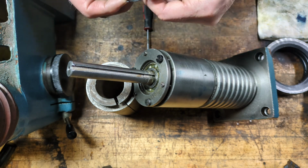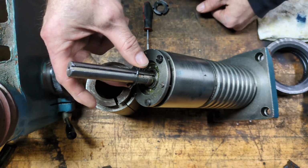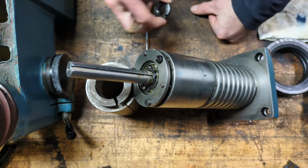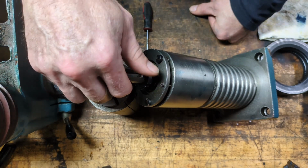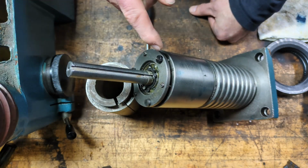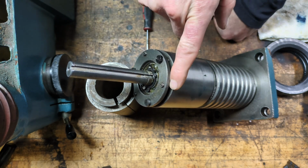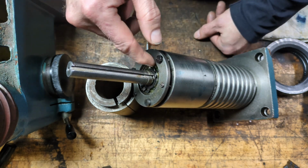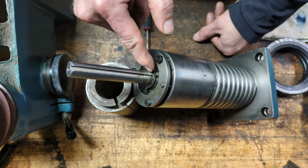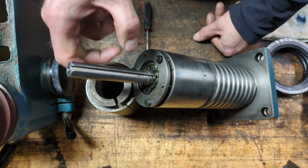Now we need to install a washer, a lock washer of sorts, like we saw earlier with the tines, and also then we have to put on this nut. And what I'm thinking is that if, for example, this piece were lowered, if this cap were gone, then the bearing, which would also be moving in that direction with it, would be too far away from these threads to make the nut function appropriately.